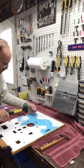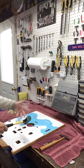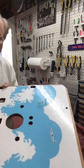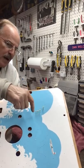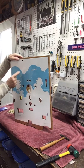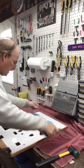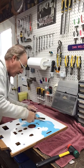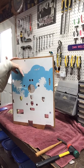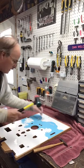As I'm putting them in, I just check to make sure each nail has a spiral. If you put a nail in and it goes in with just one hit, you know it's not a spiral nail and it's the wrong one — so pull it out. You look at these nails and they're not bad, but they're off a little. I tend to be a bit anal about it. If one is a little out of place, that's what you use your punch for — just go in and tap that nail. The ball would come in from this direction and you want that gentle curve it was designed to have.